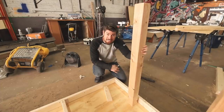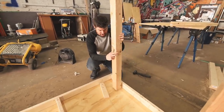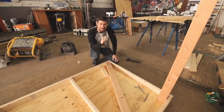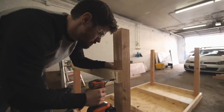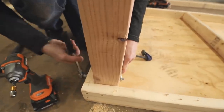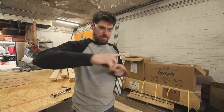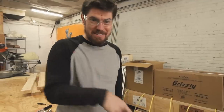The scaffolding is definitely not rocket science, but there is one design idea I had: I want to be able to reuse it and store it away flat. I'm going to use lag bolts to attach the leg structures, so when we're done with it we can take the legs off and stow it away flat. I do have a use in mind, and I'll show you later what that use is. I'm sure deck builders out there will tell me I'm probably not crisscrossing lag bolts through the posts the correct way — if you want to correct me, leave a comment nicely and let me know a better way to do it.